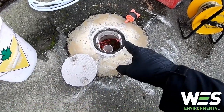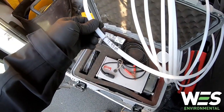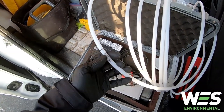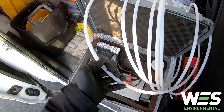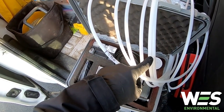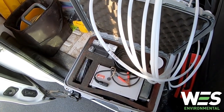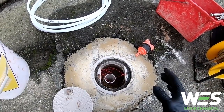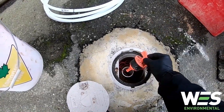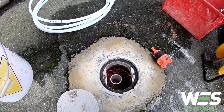The level logger is in the well and tied off. I've got my tubing here, marked at 4.9 meters. That line is going to sit at the top of the well casing so when I lower the tubing down, the bottom doesn't hit the top of the level logger. I'll turn on the pump and pump the water out. Once the five minutes is up, I'll stop, pull the tubing out, put the J plug on top, and leave it for 24 hours to see what the data says.